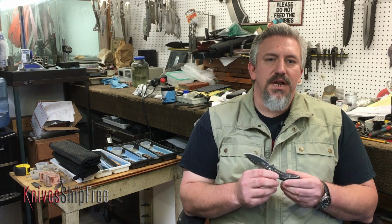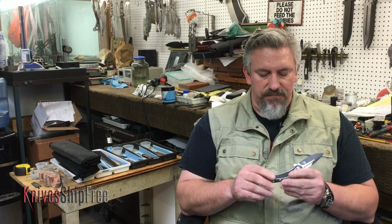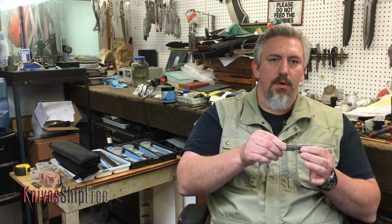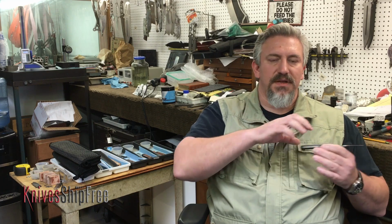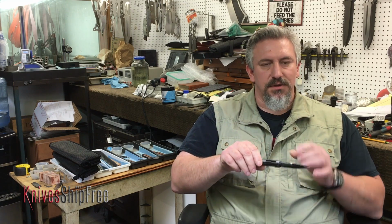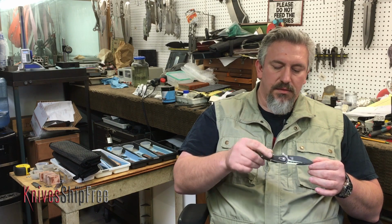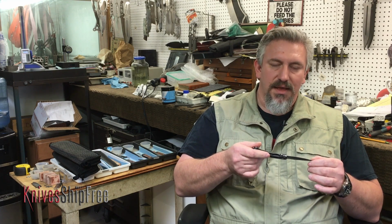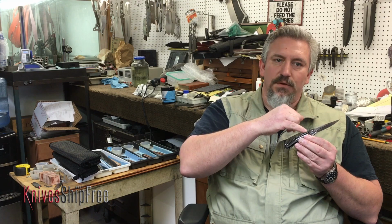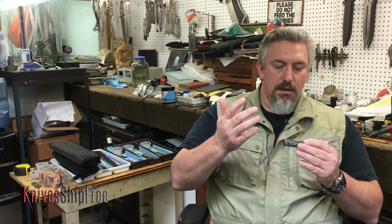A lot of people think that a production knife is just cheap because you just put it in the CNC and it's almost like it's on a conveyor belt or something like that, but it's not. If you look inside of this knife, it's pocketed out to reduce weight. So that's one setup. It has to go over on this side. It's machined again. It's taken off. It's deburred. It's cleaned up. It's colored, and then it goes back on the machine. It's cut again, and so every one of these things is hand loading, unloading, somebody paying attention to what's going on. There's a tremendous amount of attention to detail when you're doing something like that, especially when there's three-dimensional shape and two tones like this, where there's a silver and a black together, multiple operations happening that all have to be done in sequence perfectly, or else it's going to be scrapped.